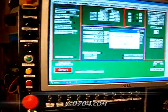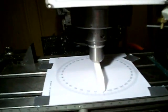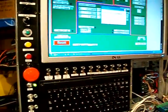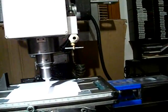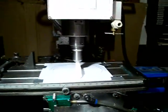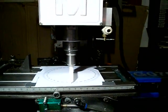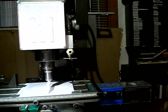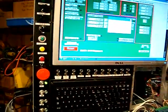A-axis calibration. I want to move 360 for now. There we go — it was about 362. I'm telling it 362, and it adjusted it. I set it to 10 revs. It's still only off one degree in ten revolutions. That's pretty good — I think I can leave it at that. I think we're good to go on that.